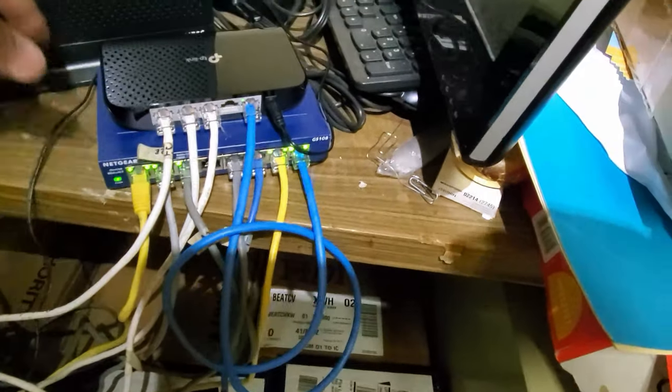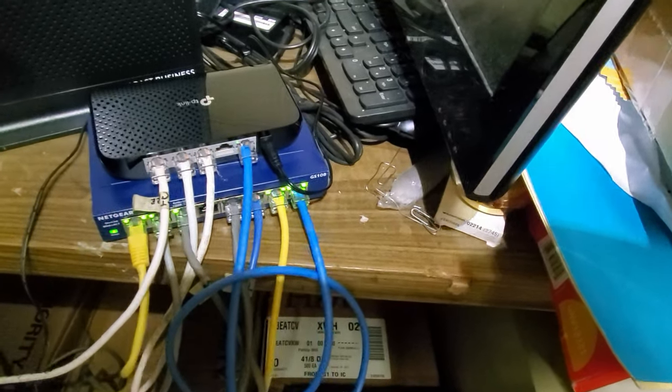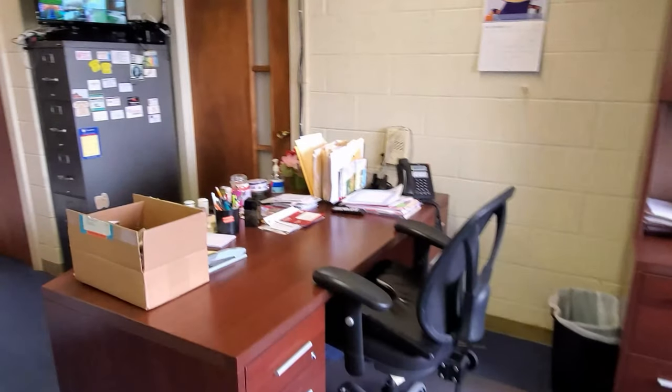We're making really good time — it's 10:30. I've got to go to Home Depot to get some pass-through plates, some RG6, and other supplies to finish this up. Alright, we got a little hub here that will bridge all the other connections I had to disconnect, so down here I think we're done. Now we're just going to move upstairs. I've already terminated all the wires for the cameras. The electricians are finishing up, so I'll snip the ethernet cable going into the PTZ camera, start mounting the access points, and go from there.